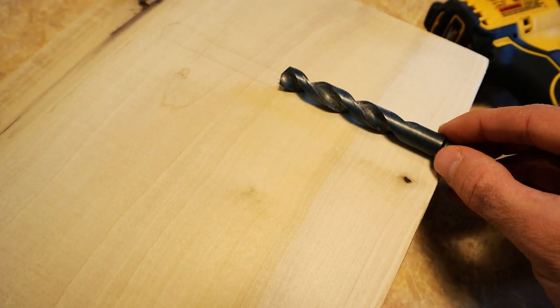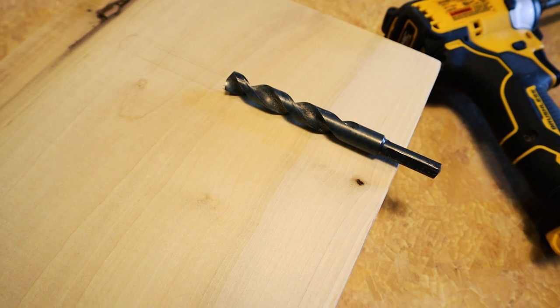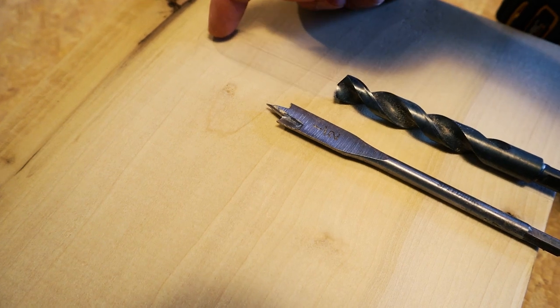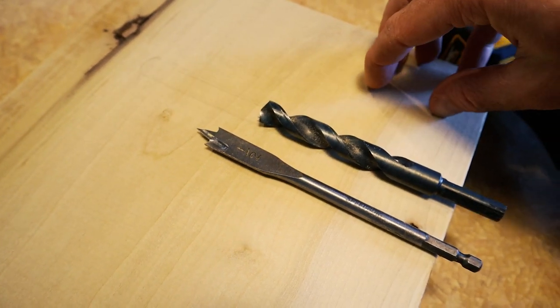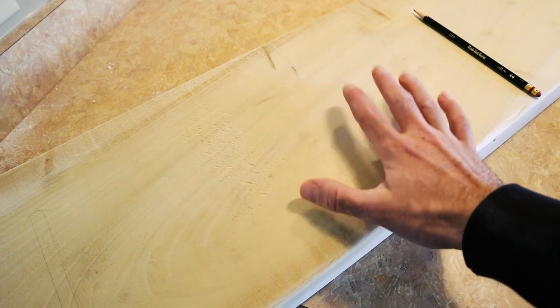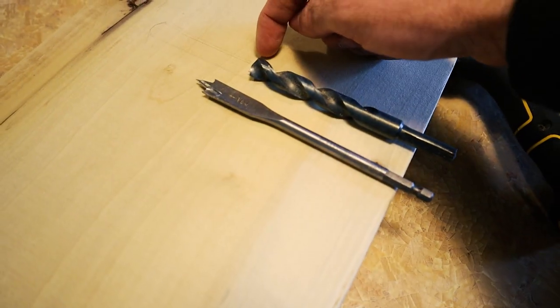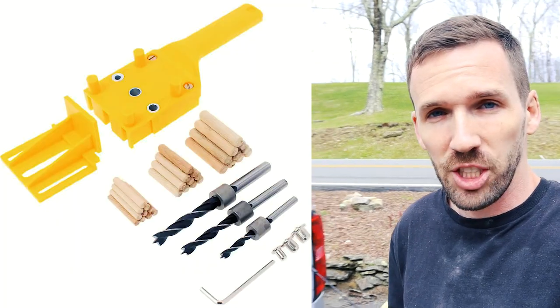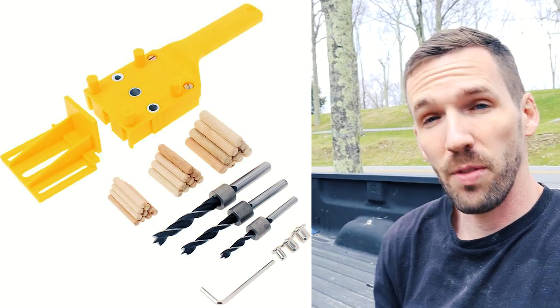We do have a problem — I don't have all my tools with me, so this is the longest half-inch drill bit I have, along with this one here. I need more reach, so I'm going to have to go to the store later and get back to this. But we can at least finish up with some stain and clear coat and get this all prepped. The next trick is drilling straight holes into this for the poles. You can't really just do that by hand — you'd be very lucky to get it to go straight. So you can buy a jig, which is about $20, and I'll have it linked in the description.